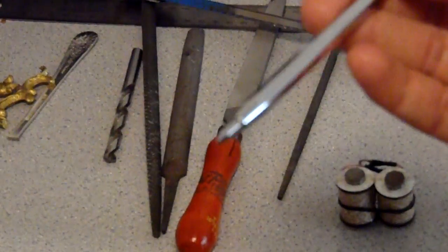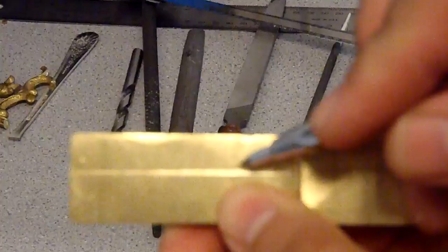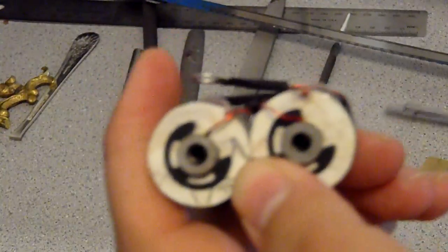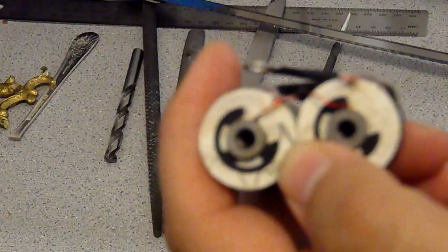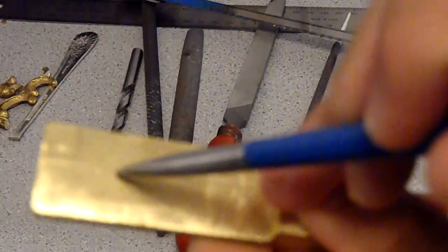You guys can use a pen. So what I have over here, instead of a regular pen or a pencil, I have this marker right here. You can get it at any hardware store. It's like a little tool that will give you a nice marking on your brass, so you won't miss it. So what you start doing is you start measuring over here from the core. You measure the distance between here and here, and in this case I have 20 millimeters. You can use millimeters, you can use regular standard measurement, whatever works for you, as long as it does the job. So in this case I have 20 millimeters. What I'm gonna do, I'm gonna grab a punch, and I'm gonna punch it right here, 20 millimeters from here to here. I already have them marked, so I'm gonna punch it and drill it.